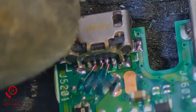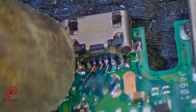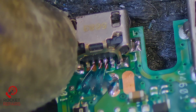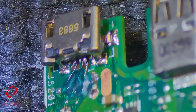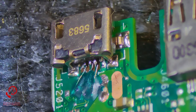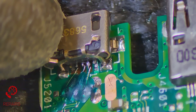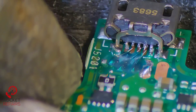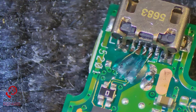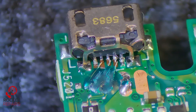I'm going to try and explain this the best I can. On the previous video I may have mentioned that there was ground underneath this port which is helping it stay secure. That ground pad has ripped off so we don't have the security from ground. However, no excuses here whatsoever — look at the soldering on the legs if I tilt this board. The port has come away from the chassis, but clearly I didn't add enough solder in any way, shape or form to these legs in that video. We all make mistakes and we simply have to own up to them and rectify what we can. If you don't make mistakes, you'll never learn from them.